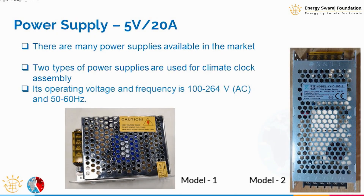Just to be on the safer side, the power supply chosen for this assembly is a 5 volt 20 ampere power supply — remember, this is what we need. In the market there are many types of DC power supplies available. In design it is very simple: one side has AC input of 230 volts, and the other side has DC output of 5 volts and 20 amperes.